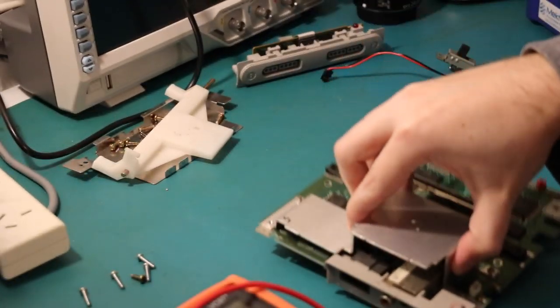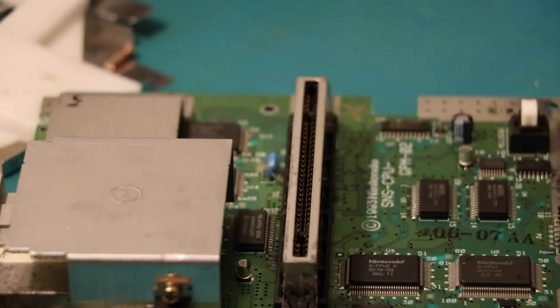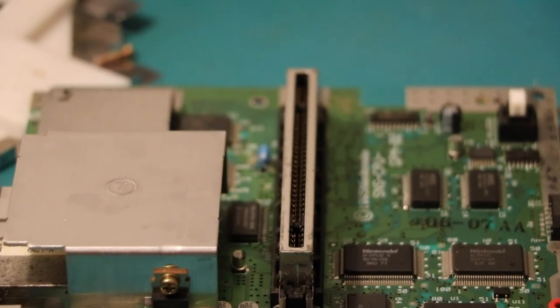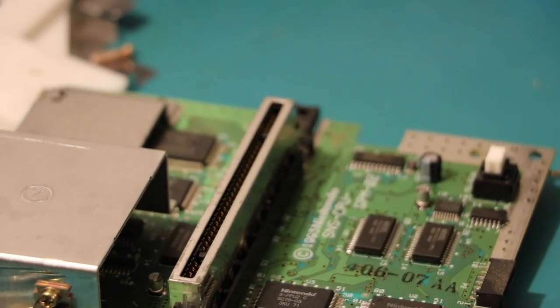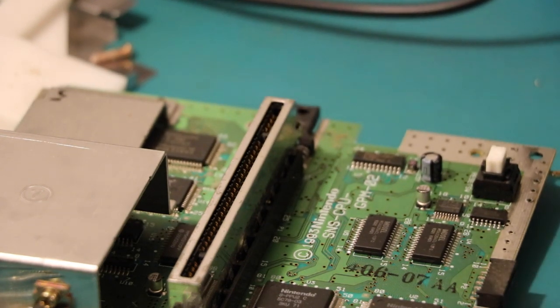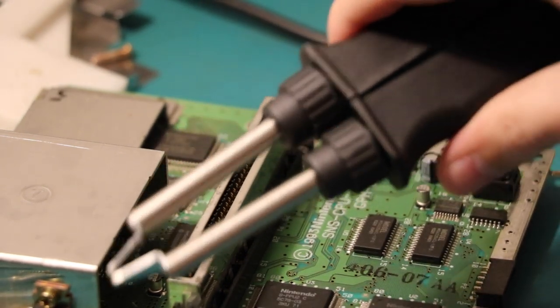And then you just want to really meticulously go over everything, especially near the microchips. I know, that's not very specific. Of course, this could be a capacitor thing, but I don't have any capacitors on hand to replace. But when I do, I've picked up a Hakko Hot Tweezers, an FX8804, which will be great for melting everything off here.